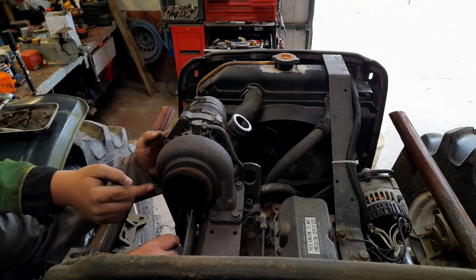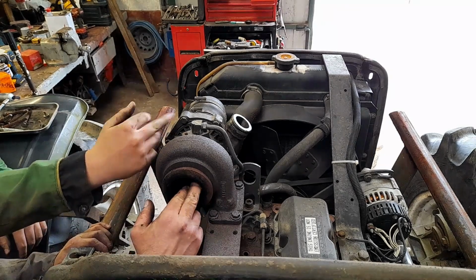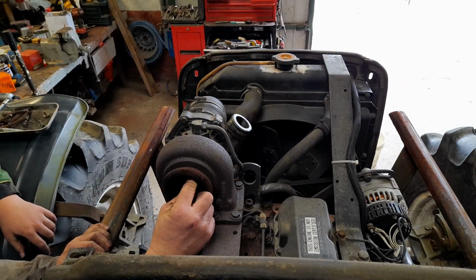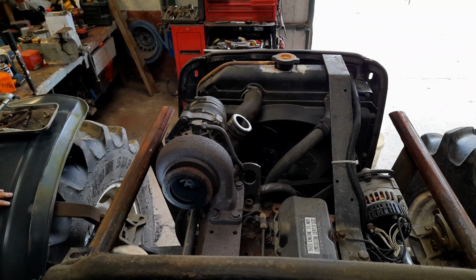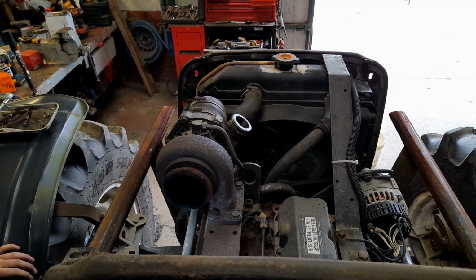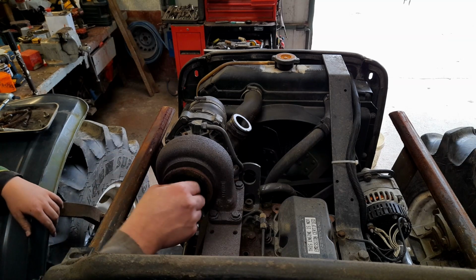Air comes in here. It's driven by the exhaust, which turns the turbine, and then sucks air into the engine to get it more. You can get your torch and have a look in here if you want. The fins are bent, the propellers, the bucket. That's a good nick to me. So when it whistles, is that just the air going through? Yeah, not when they start whistling, they're starting to look knackered.